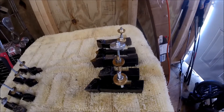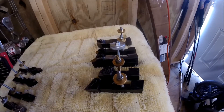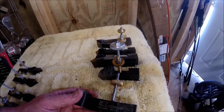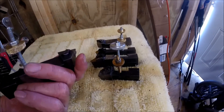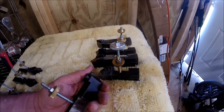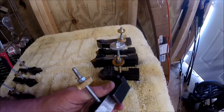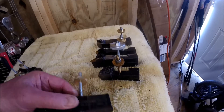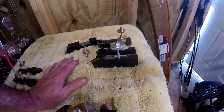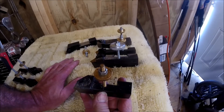This is the presentation. These are the tools I have gotten modified for my Grizzly. This is a DDJNR164 — a Kennametal holder for a DNMG insert. I don't have any of these inserts, so this is just the holder. You notice it's dovetailed, and it's got the quarter-twenty that I've drilled in and loctited. This is a MCLNR164, which basically uses your CNMG type insert.